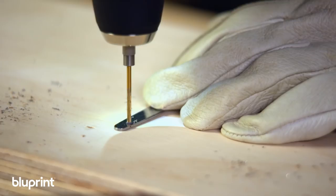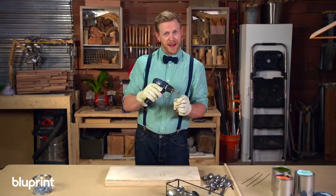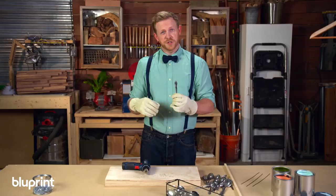When you're drilling your spoons, you want to make sure that you're actually drilling through the face of the spoon and not through the back. The reason why is that if you have any burrs that come up because of the drill bit, they'll actually be sticking out through the back of the spoon and not onto the front. As you'll see, it's nice and smooth on the front, but there are actually some burrs sticking out on the back.